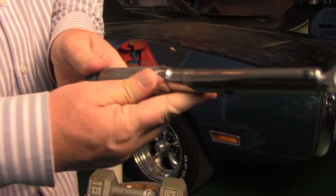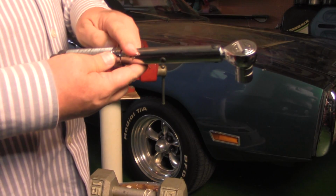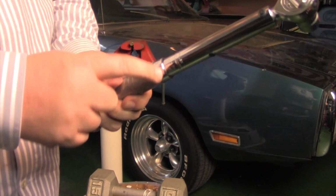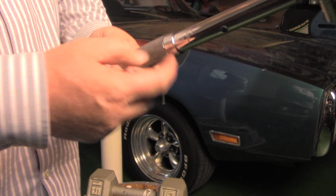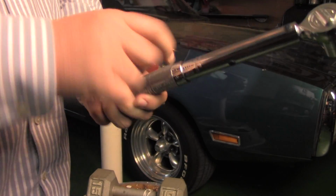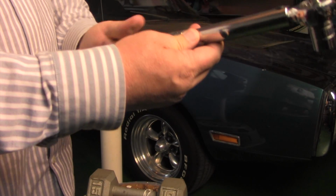Once again, I get questions from you guys on a regular basis about how to set something like 22 foot-pounds of torque using an inch-pound torque wrench. It's really easy. These are graduated, so this one around the handle, those count as a single foot-pound, and it goes from 0 to 9. These little slides count in inch-pounds, so 120 means 10 foot-pounds, or 120 inch-pounds.